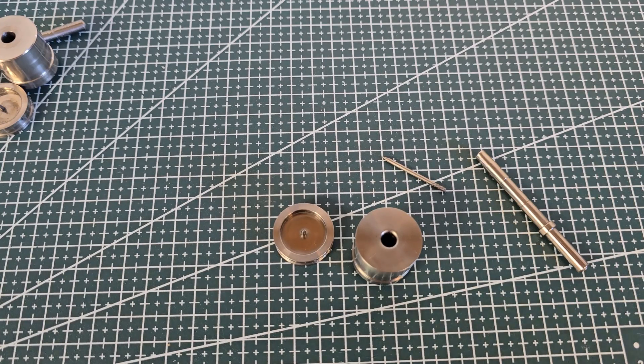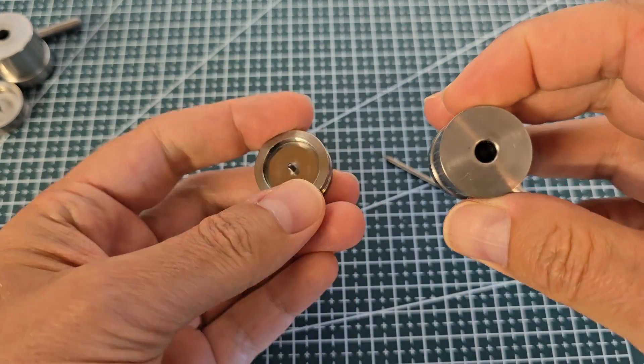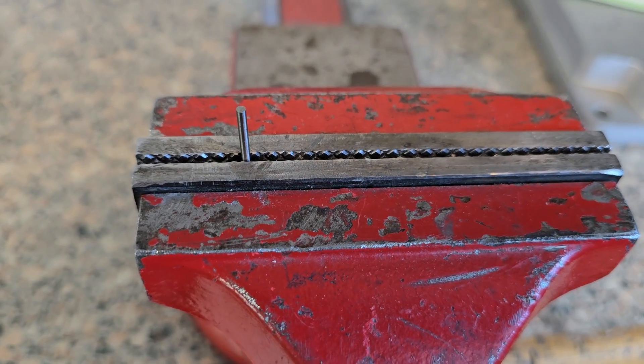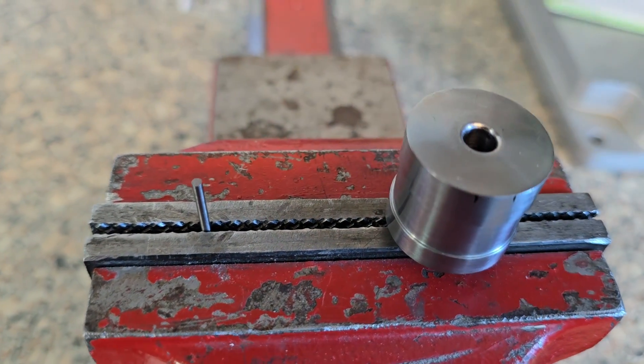While I was testing, I ordered all of these parts from PCBWay, but if you're looking for the cheapest option, then the only parts you actually need to be manufactured are the main body and perhaps the base. Alternatively, the base can also be replaced with a 2mm pin secured in a vise at the desired length, though this is less flexible than having a proper base.